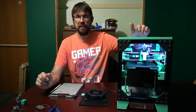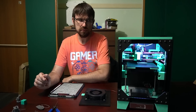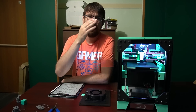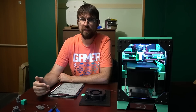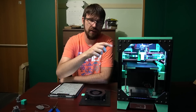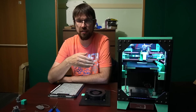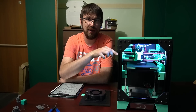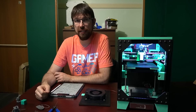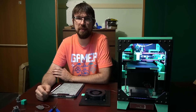I am using a VZBot HextrudORT extruder — this is the Mellow version. I highly recommend this extruder. That is kind of the spec for this printer, however I have no doubt there will be mods for Sailfin, Sherpa Mini, Orbiter 2, and all that kind of stuff. A lot of the cost comes from that extruder. There's also a big cost in bearings — this printer uses a lot of F695 bearings because it's so compact. I'm wrapping the belts around the rear 2020s and there's a lot of bearings needed to do that. There is a dedicated Panda Mini channel on my Discord already with a lot of feedback, and a couple of people already building the printer.